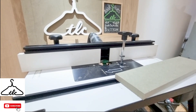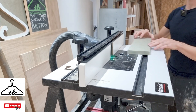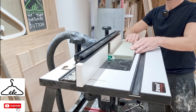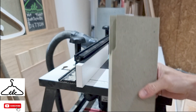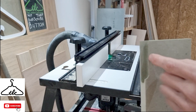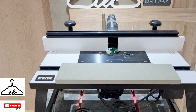To get a bigger lip I've unlocked the router and I'm going to give it a few turns at a time — don't go too mad. So we've now got a fatter part here, which is where you're going to pull the door open from. But the problem is we've only got 10mm from front to back. If you had a side panel you wouldn't have enough room to get your fingers in. We need at least 20mm from the front of the door back to where your finger's going to pull. I'm using the tape measure on top and I need to go back 10mm, so I'll give it another go.